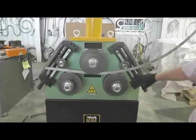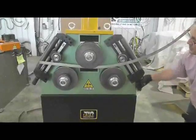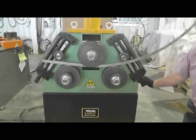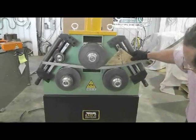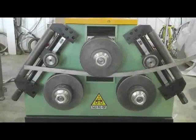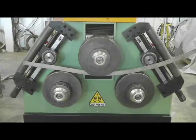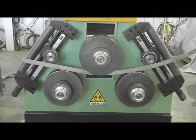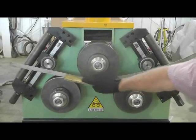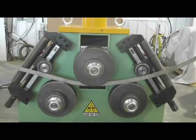I'm going to do a second pass. I'm going to release the tension off of this cam roller. Since I'll be moving the forming roll down, both ends of the angle will kick up. I'm still going to contain it here slightly. I have about this far to go, so I'll move my forming roll down to make up this difference approximately. We'll roll through. Now we've got an unbent straight, so I can't fully engage this roll until I pick up the bent part. I don't want contact until I reach this part or else I'll unbend the profile.